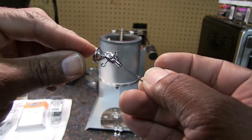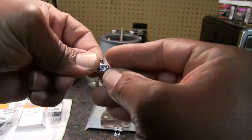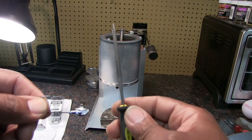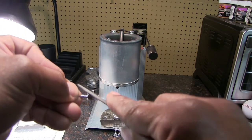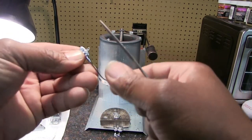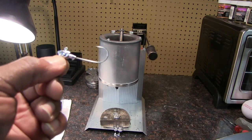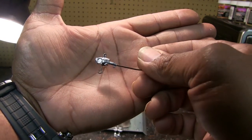There's a piece on the front that I just go back and forth with and break it off. I've got a little small overrun on the top, and I like to get my small file and just go over it slightly to knock those overruns down and any other slag you might have on the outside - just barely go with the file and that will make it a nice underspin jig head ready to go.